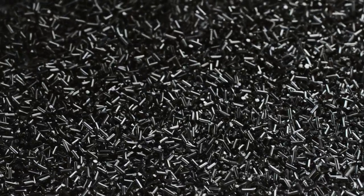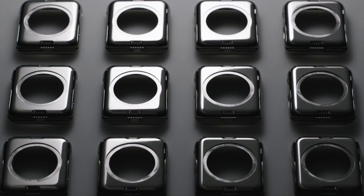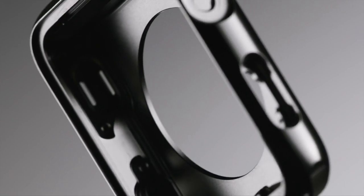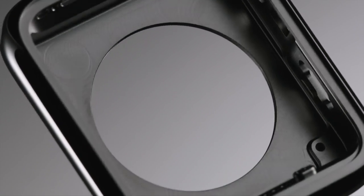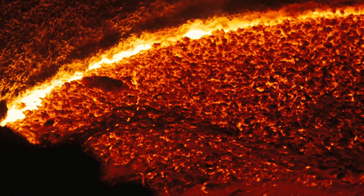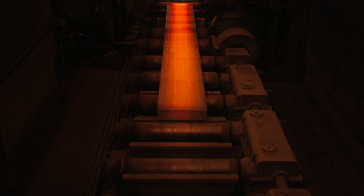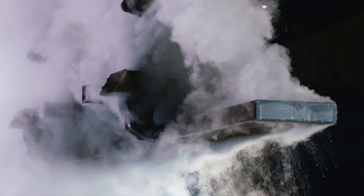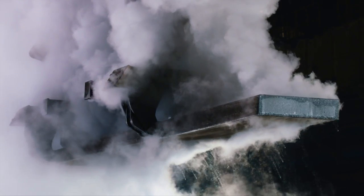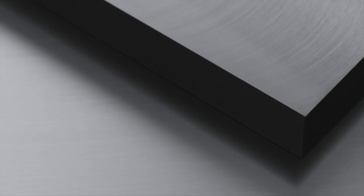There's a reason stainless steel has long been used to make fine watch cases. For Apple Watch, we start with an alloy of stainless steel known for its strength and corrosion resistance. We then customize it through a series of alloying and processing steps to make it even stronger. While in its molten state, the composition of the metal is tightly controlled to minimize impurities and ensure hardness. This is followed by a specialized cold forging process that helps to make the metal up to 80% harder and less susceptible to nicks and scratches.